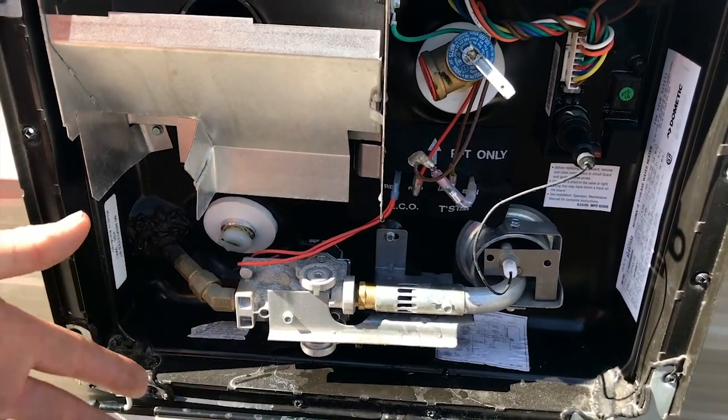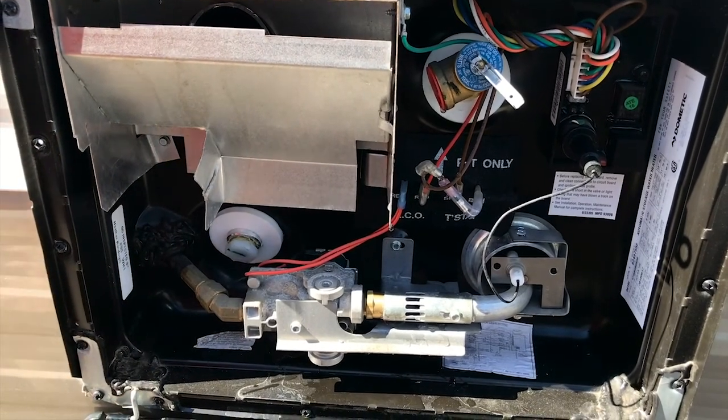So there are two main different types of tanks: Suburban and Atwood. Suburban is the one that has the anode rod. An anode rod is a rod that inserts into the tank, and the purpose of it is to attract the salts and minerals in the water to attack the rod rather than the lining of the tank. A Suburban hot water heater has a metal liner, so without the anode rod, the metal liner itself could rot out with rust. On an Atwood tank like this one, the liner is either fiberglass or glass-lined, so there's no need for an anode rod because there's nothing for the minerals and salts to attack. That's the difference.